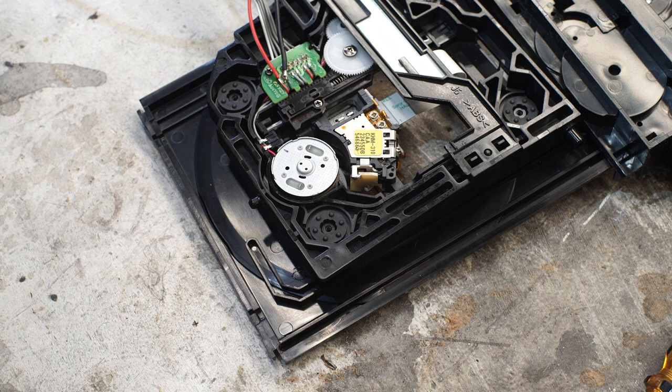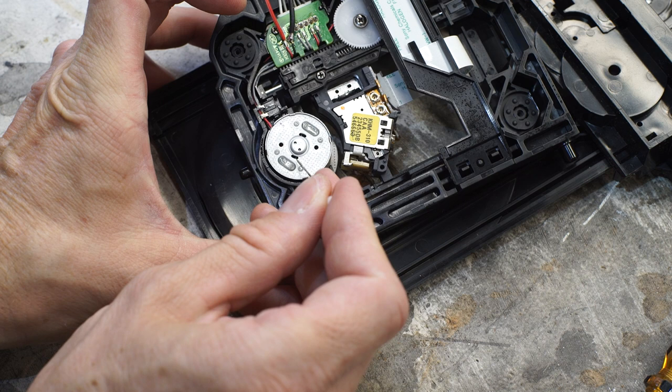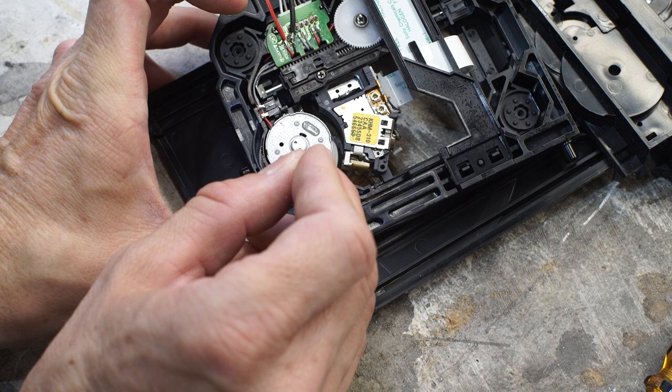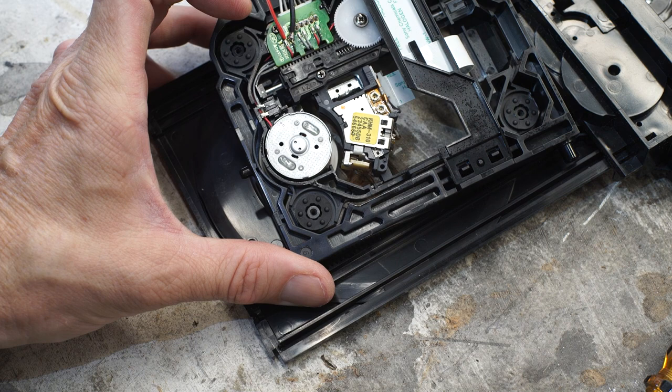I've been tinkering and I found the problem. I've got power connected up, and inside there's a brush here and a brush here at the DC motor. I figured out that this particular brush — if we touch the brush lead itself, the motor will spin. Something to do with this brush. I don't know if it's going to be repairable or not — honestly we should just replace the motor, but I don't know where to get one. Maybe I'll try bending the lead a little bit.